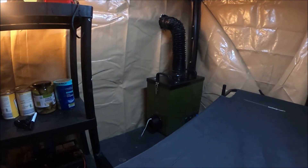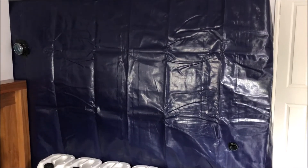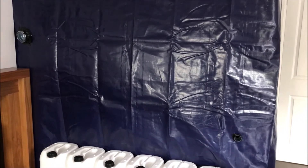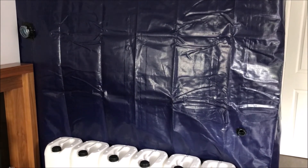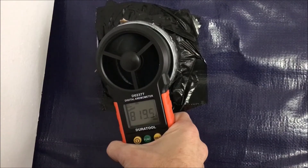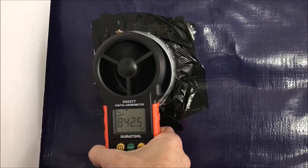Here it is running at a higher speed. Looking at the shelter from the side, you can see on the left you've got a 100mm duct inlet and at the bottom right you've got a 50mm exhaust hole. This is a 100mm pre-filter which is available online and comes in its own housing. The airflow meter is showing about 800 feet per minute, which is about 53 cubic feet per minute.